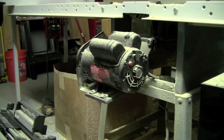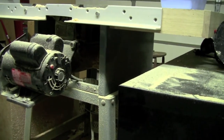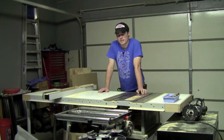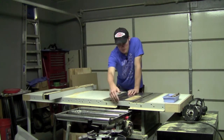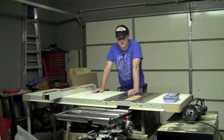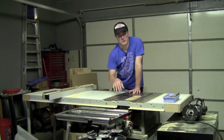The table saw is a one and three quarter horse motor. It runs at about 3,500 RPMs and it is adequate horsepower for the needs that I've had. There have been times that I've bogged it down with some really hard woods, but overall, 95% of the time, I've been really happy with the horsepower it puts out. I will be taking some plywood and blocking all that off so I can have it for adequate dust collection, because there's going to be a dust collection chute up underneath that going out the back.